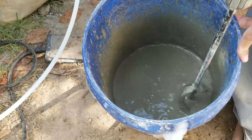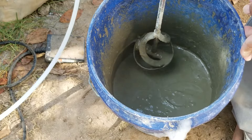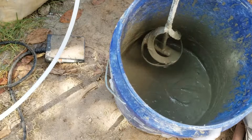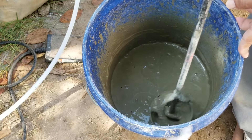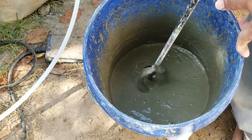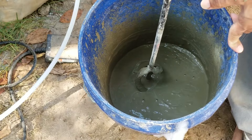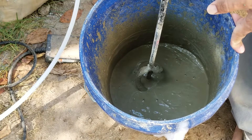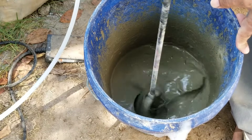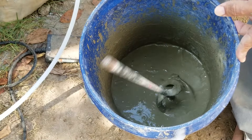When you're mixing, be sure to control your drill and go around the sides of your bucket or garbage bin, because the cement tends to stick in corners. Always make sure the bottom of whatever container you're using to mix your slurry in doesn't have ridges — it should be a flat-bottom container. This is our cement mixed with water — we now have a cement slurry.